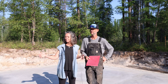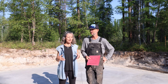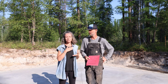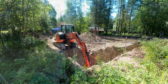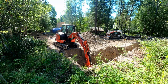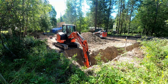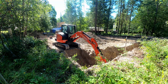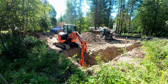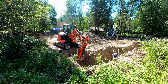So this slab is quite intense. They dug the foundation — what's the size of it? It's 30 feet by 50 feet, so 1,500 square feet. We cleared this area. Doug, how far deep did you guys go for the foundation? We're about four and a half to five feet, depending on the grade. The footings sit four feet below grade, which is below frost, so it stops heaving.